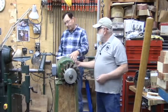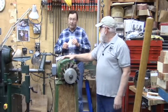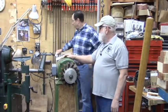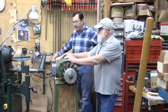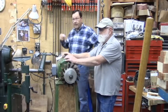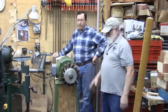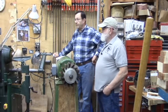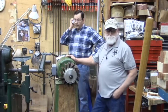We're going to talk about why you would even want to buy a three-phase piece of equipment. I'd say probably the biggest reason is durability and basic reliability. It's stuff that was built to run 24 hours a day, 7 days a week. It's some of the toughest industrial machines you'll ever find. If it can put up with that kind of stuff, there's nothing you can do to it in the short period of time that you'll have it that will wear something like that out. So I think that's probably the key issue with three-phase.